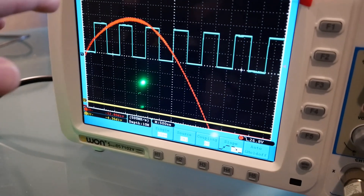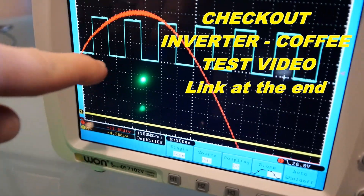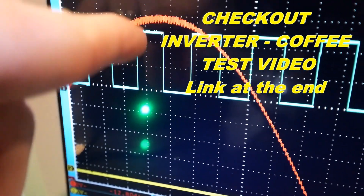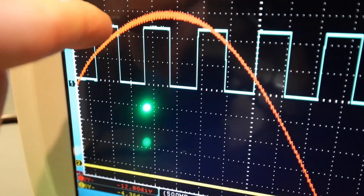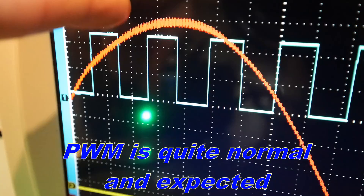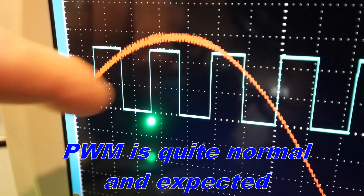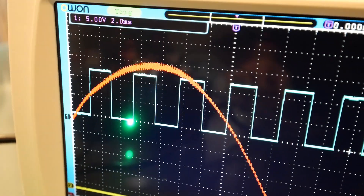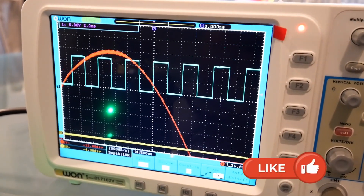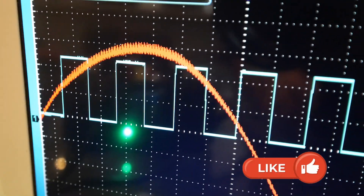If I wanted to be really picky, zooming in on the sine wave you'll see a little bit of noise on the waveform. That's actually the inverter circuitry switching on and off to create as close a sine wave as possible — it's an indication of pulse width modulation, basically flipping and energizing the coils on and off to generate the voltage curve. The overall sine wave quality is excellent; I can't imagine any device not running perfectly fine on this, and even the highest quality pure sine wave inverters will probably have a similar level of noise.